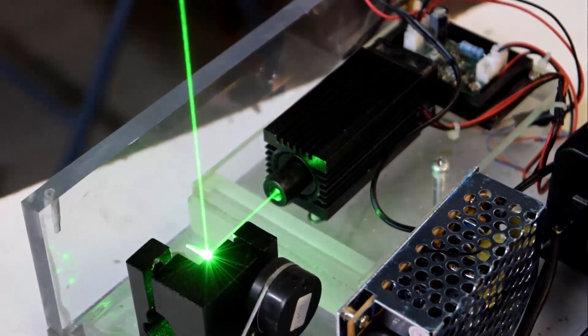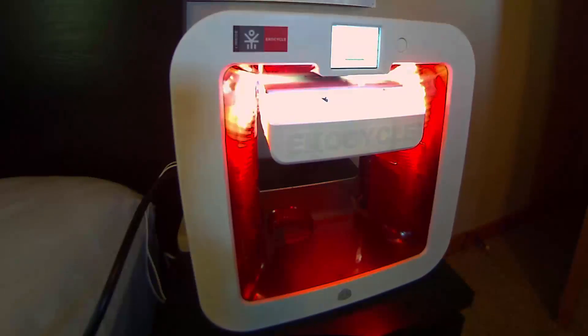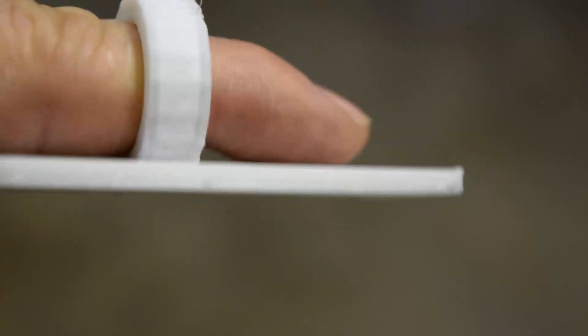Because the laser is not quite as powerful as we would like it to be, we need to get maximum reflection from the beam when it's broken. To do this, I printed some finger pads using a 3D printer. The white plastic reflects most of the laser light down towards the sensor. With a brighter laser, you could just use your finger to break the beam.